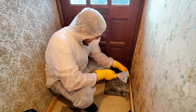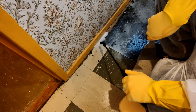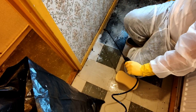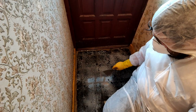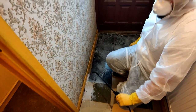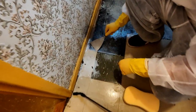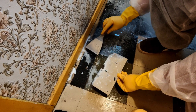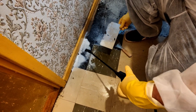It's best to use something thin like this and just scrape underneath it and try to break the tile free. Tiles like this where they're already cracked are likely to crack again when they come up, so just give it an extra bit of wetting. You can see the floor's fairly wet as I go, but this is what you'd have to do before you lay screed anyway — prep the floor with PVA bonding. Have a look at this one now — that one's come up quite clean. There's a little bit still in there.